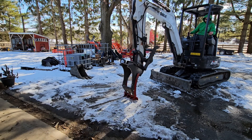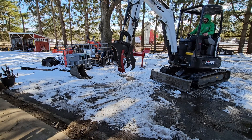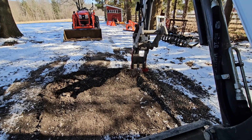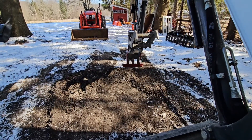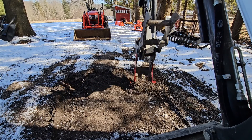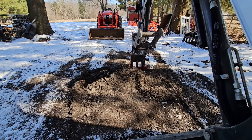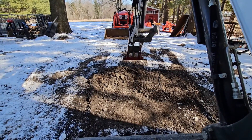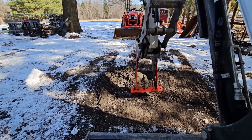Here we're going to try out a spot in the driveway — we're going to start digging in a little bit of a hole. Here we're going to simulate grading some driveway material. This is number four asphalt and asphalt fines that I used to build my driveway here on the property. I used the blade of the machine to make kind of a hole and have some material in the back there, and here I'm just working on spreading it out with that blade. As you can see, you can see the holes between the two teeth right above the red bar there — that kind of acts as like a screening mechanism.